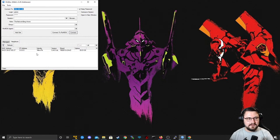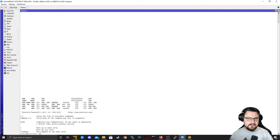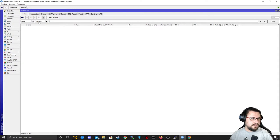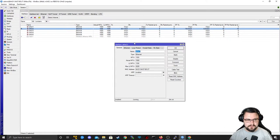I'll disconnect and reconnect. When I look at Neighbors I'll see the IP address received from DHCP — and there it is. Now I can connect with that IP address. Next, I want to show setting passwords. In QuickSet we added a password, but let's do it properly. Go to System > Users. The admin account is always there — it won't go away — with the username admin.